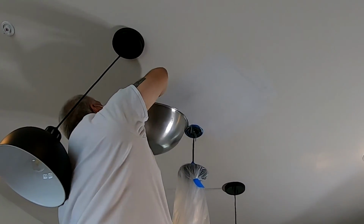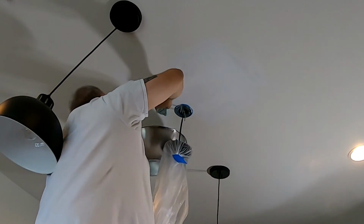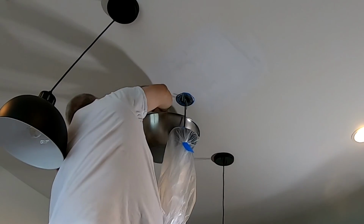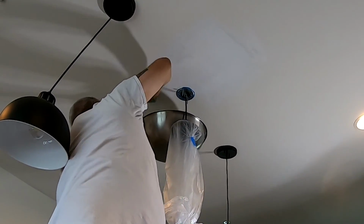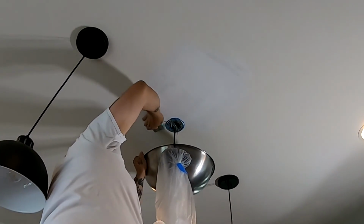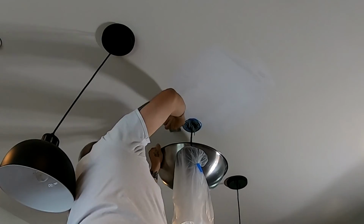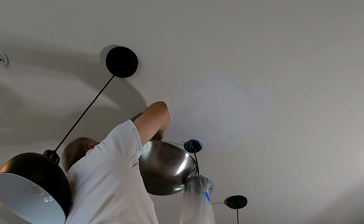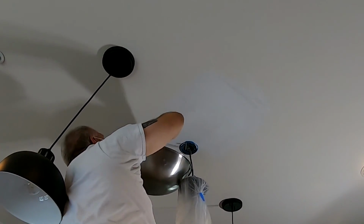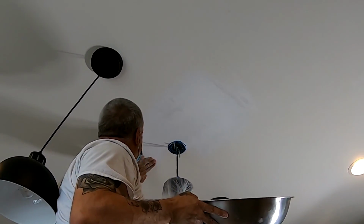If you want to leave a groove or a build up, like a line where you pulled your trowel off the ceiling and it left a liftoff mark, you can sand all that out. You can sand off anything that is protruding from the ceiling or the wall, but you can't really always sand off anything that's a crater. So try to keep it smooth with liftoff marks. That's fine. Hone in on your skills of sanding.